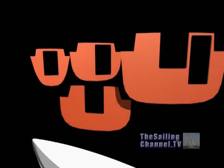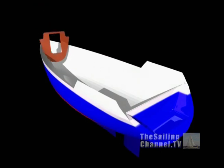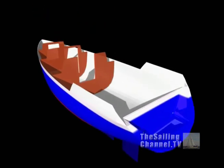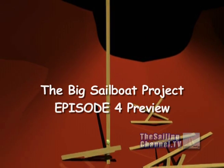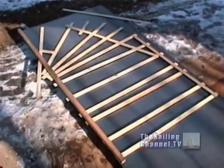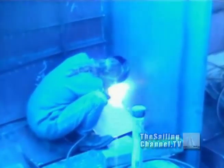February was an unusually warm month, so the bug got us and away we went. It was decided unanimously to put in the aft bulkheads. As you probably know, bulkheads divide off areas of the boat for privacy, extra space, and in our case, safety. We saw a really neat method of battening in a bulkhead on TV — little fencing sticks are hot glued together to make the exact shape of the hull at the exact location of the bulkhead. The templates are carried down and positioned correctly on the plate. By the end of the second day, both sides were in.